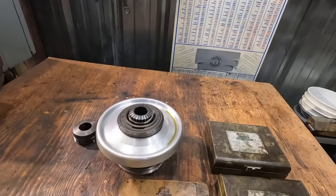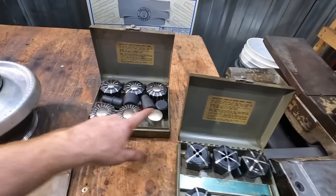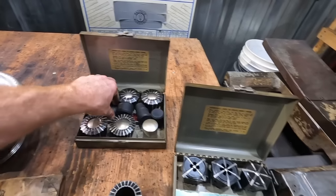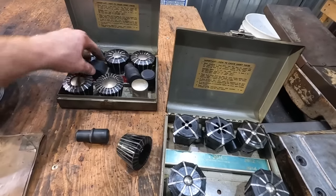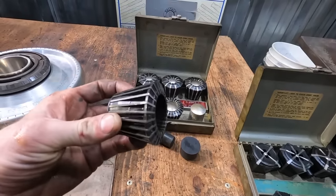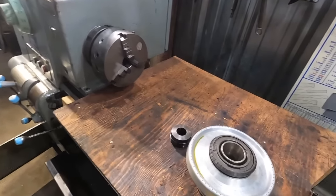The beauty of this spindle chuck, if you have all the pieces, is that there's a whole set of different sized rubber collets that go with it. And so I have the entire set. There's 5 in that box, should be 6 in that box with this one. And then sometimes if you need to have a little bit of support on the backside, you'd put the corresponding one in the backside of it. Then it's not squeezing the back of it more than the front of it. These are really nice, but they're very specialized, and a normal 3-jaw is really the majority of what I'm gonna need.